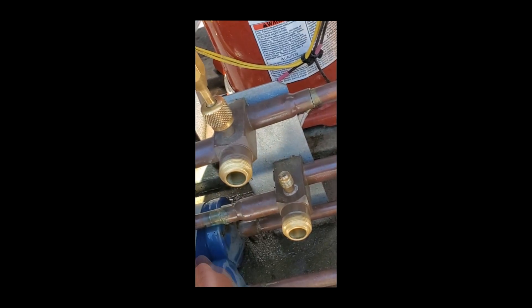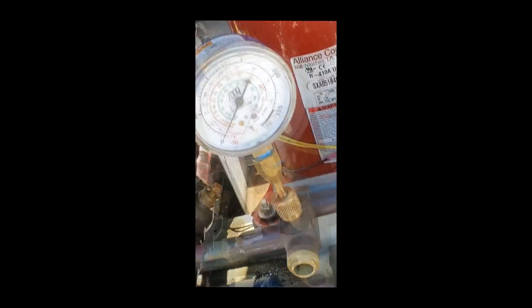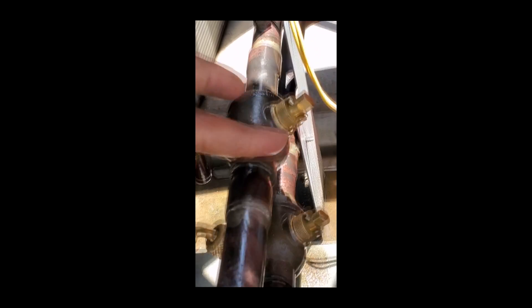From this point on, both circuit A and B - all that's evaporator from this king valve, that king valve. All that's going downstairs somewhere to the evaporator. Everything - all my pressure - I got a little trace gas in this one. Circuit B goes around here and then right here. I'm going to put some liquid leak detector right here.